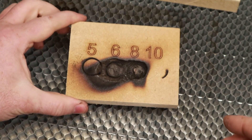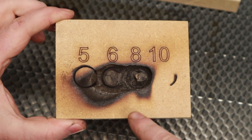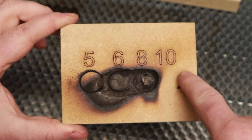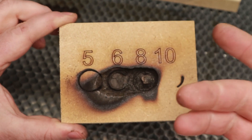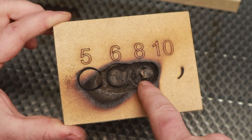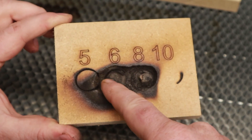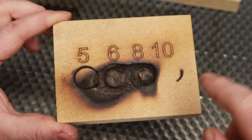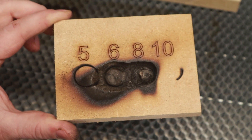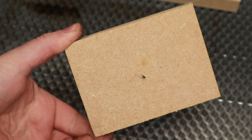Moving on to the MDF — well, it speaks for itself really. It's quite disappointing. It just carried on burning; I think the MDF held the heat. I stopped it before it completed ten passes because it was pointless carrying on. After eight passes you can see it's just left a little bit of a nub. The laser would cut it and the MDF would just carry on burning, so an 18mm thick piece of MDF is probably not the best material to use — it didn't manage to cut anything out.